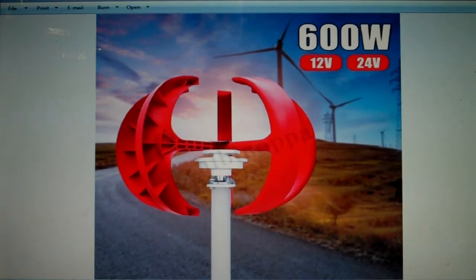because they have to be somewhere around 600 revolutions per minute to start producing power. When they get up over 600 revolutions per minute, they produce power. Well, these vertical axis wind turbines can't get up to those RPMs, so they basically produce nothing. But like I said, if you see the videos where these guys are putting drills on these motors, they're spinning them at 600, 800, 1,000 RPMs, and yes, they will produce power. But on the low end, no, they won't.